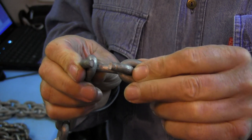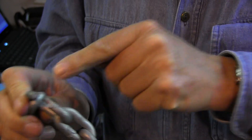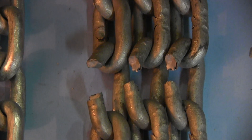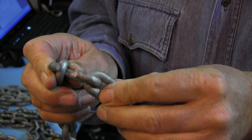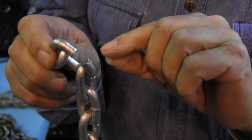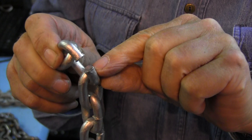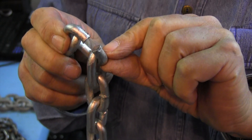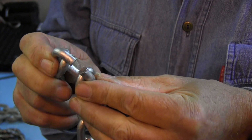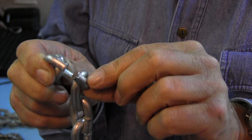This is a fracture that has taken place immediately adjacent to the weld — it's also a cup and cone type, with a cone shape there and the cup there; this is the weld here. So the fracture has taken place in the area that was heated during the welding operation. In this further example the fracture has taken place immediately at the weld, and when we examine these faces with a magnifying glass we can see marks consistent with where the chain was cropped during the manufacturing process. This suggests that the welding is incomplete — we have what's known as poor penetration, and the metal has never been welded correctly.